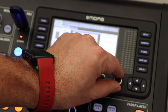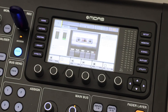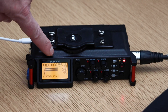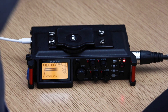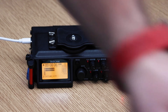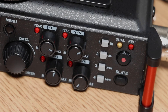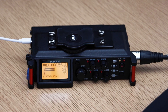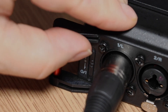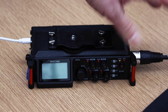Let's get something up on the desk to play at the same time — I'm going to go over to play here. You can see the audio coming through just fine. I'm also getting feedback because I'm still getting audio from the two mics, so I'll just turn those off for a moment. When you finish recording, you just press the button at the top — it has a square there. Press stop and it stops recording — that's all finished. When you've finished, push the hold button down and it will turn itself off and off it goes.